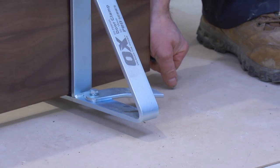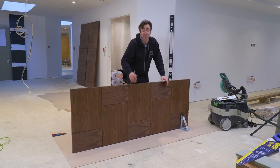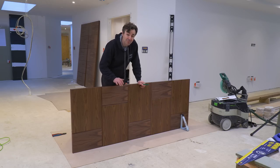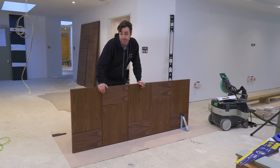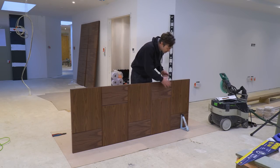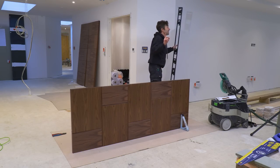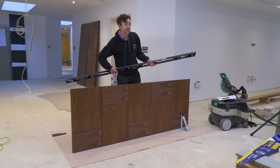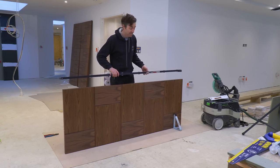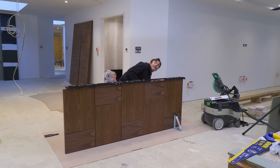Check those staples come out — the last thing you want is to hit one of them with a blade. This door is for my study, picked for no reason other than it doesn't need to be part of a pair. The next job is to route the hinges in. I'm pretty confident it will go straight into the lining, so I'm going to route the hinges here, route the lining and we're going to swing it — that's as simple as that. I'm going to be using a hinge jig — it's a skeleton hinge jig.